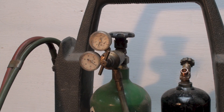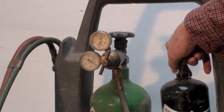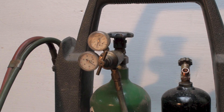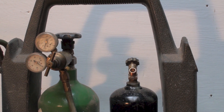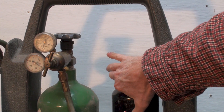This is the acetylene cylinder — you'll notice it says 'dissolved.' Acetylene is our fuel gas and it's interesting stuff. When acetylene is pressurized above 30 pounds, it becomes unstable and can spontaneously explode. A full cylinder is at 225 or 275 pounds, so why doesn't it explode? Because it is dissolved — dissolved in acetone.